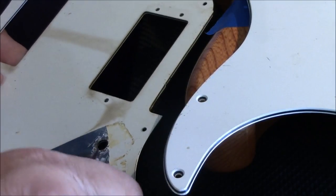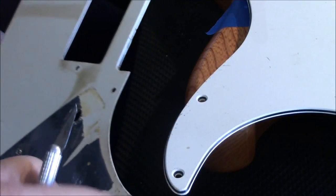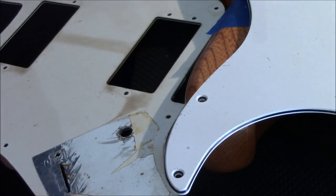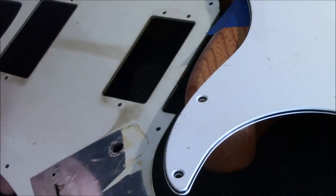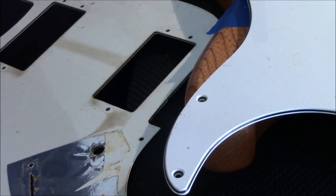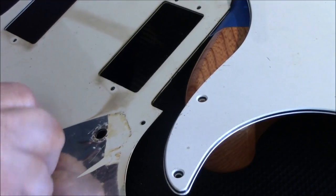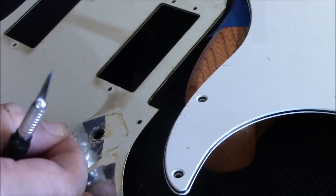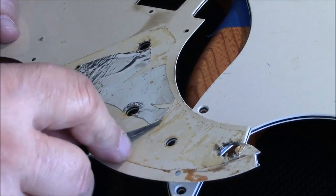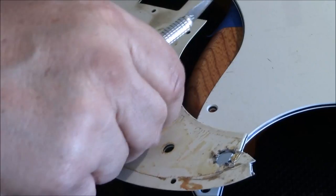So I'm going to start off with hot water and steel wool, just lightly abrade it. Slightly kind of sand that stuff off there rather than trying to chemically remove it. If that makes any sense. I hope it does, because that's the best way to do this. I have seen boards just absolutely melt, with some of the solvents tried on them, seeing the aftermath, what's left of them. You don't want to cut into the boards, you want to cut under that tape. Get a nice area to pull.